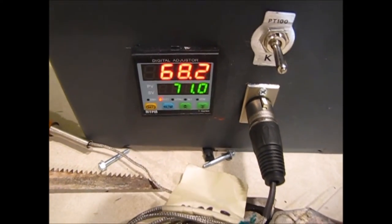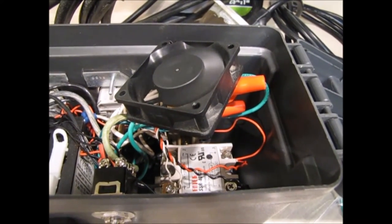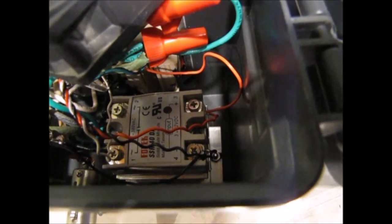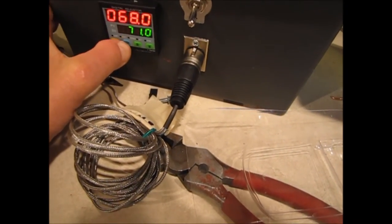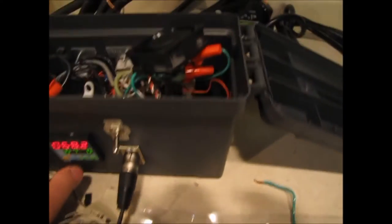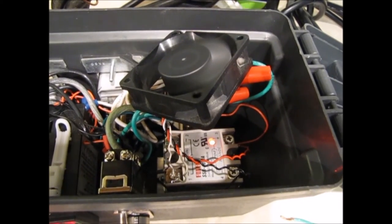Now if you see — it's about 68-71 degrees outside — I have my thing plugged in, and you'll notice the fan is working. What I did is hook the fan up to the PID output slash SSR input, so when it kicks off the SSR it's going to kick off the fan. I'll set the temperature up a little bit. With the SSR powered up the fan works pretty good and still cycles on and off with the SSR.